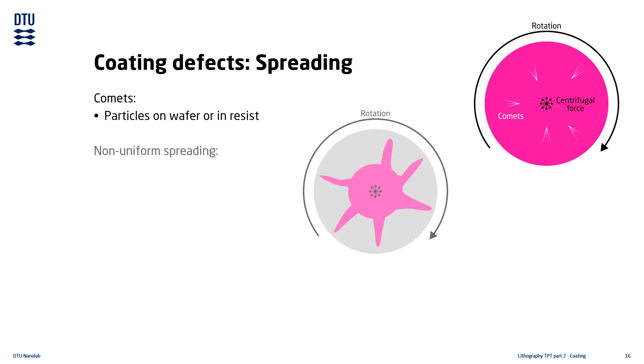The second type of defect is highly non-uniform spreading of the resist. This is often seen with substrates that have insufficient wetting or when using very thick resists. Substrate wetting problems can be associated with the substrate pre-treatment, which will be described in a later lecture. One issue with dispensing thick resists is that it can be a slower process, giving the solvent more time to evaporate from the surface — creating a skin on the resist that can be difficult to break, or leaving behind a circular imprint of the edge of the dispense volume.